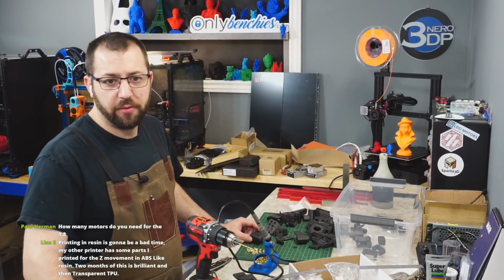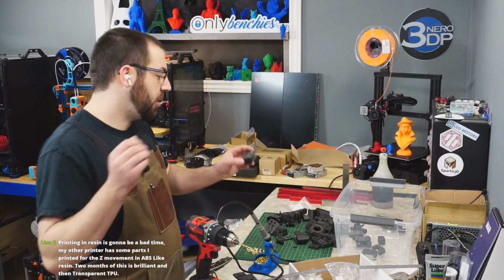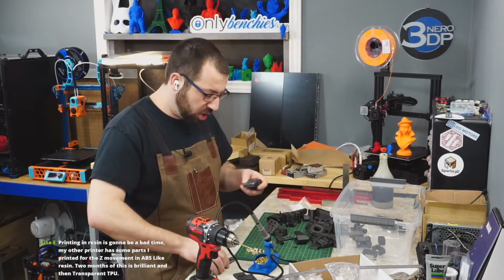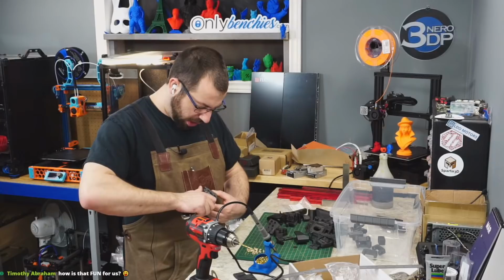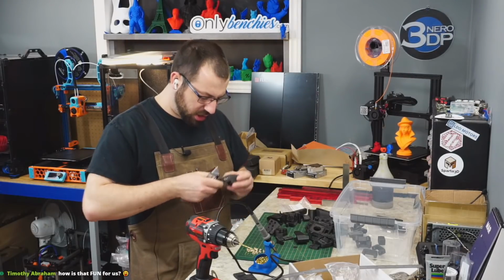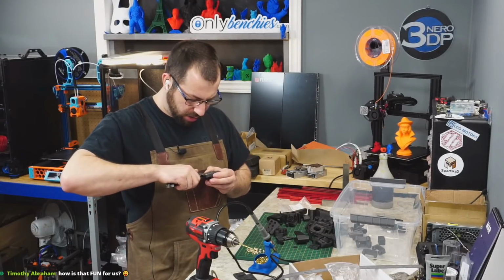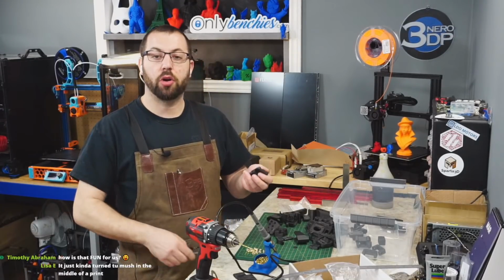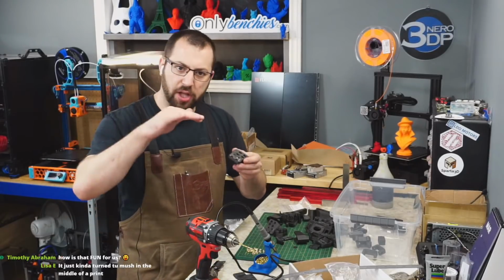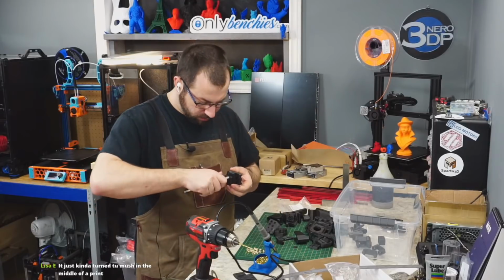Oh yeah, Dust Boot, I'm gonna forget heat sets, don't worry. How hot is the soldering iron? As low as it can go. Unfortunately, mine's actually broken, so it's on whatever temperature it is right now. The little knob for controlling the temperature is broken on mine. So I think I'm a little hotter than I need to be. Basically, you don't want to cook the insert. You just want them to melt into the plastic. Too hot is bad.